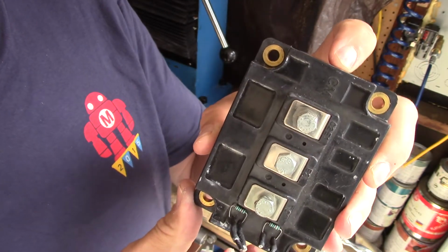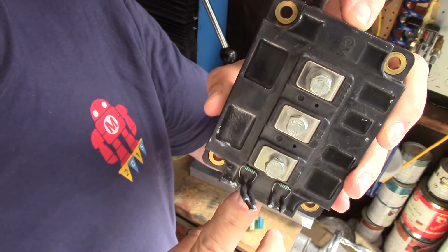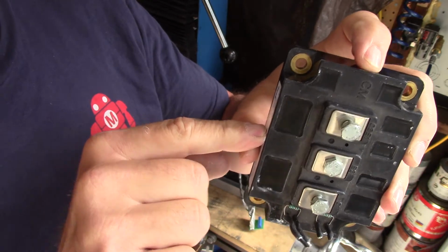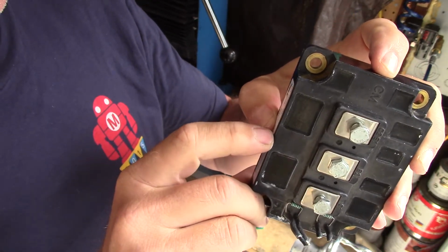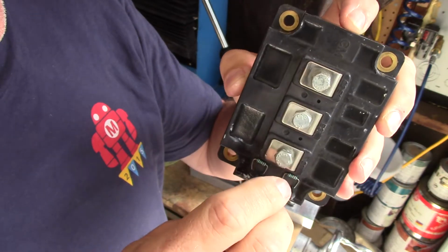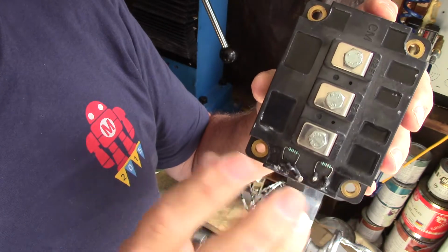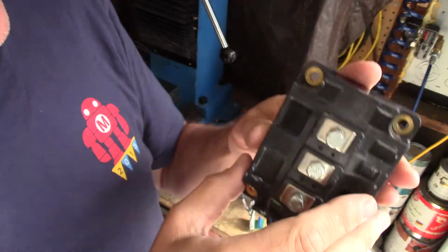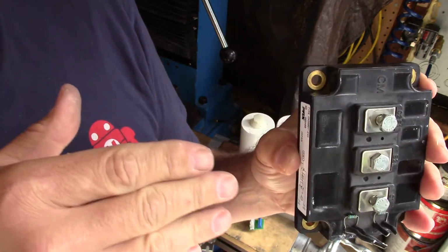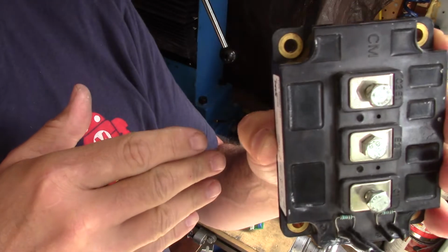We set up a V plus and a V minus, so we set up a power supply and a ground, and then we provide an input signal, and in this case the input signal is going to be the pulsing that's circulating around our primary in our Tesla coil, and we're going to alternately turn that on and off. Now we're going to use two of these ganged up with each other so that they're doing the opposite thing. So when one's on, the other one's off. When the other one's on, the other one's off.